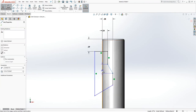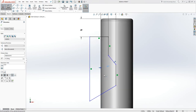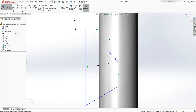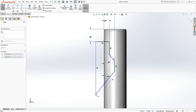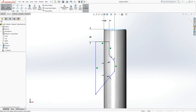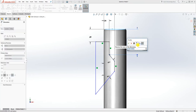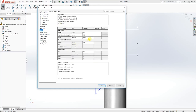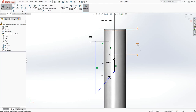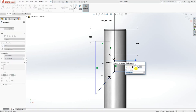This angle is going to be 41 degrees, and this angle as well is going to be 41 degrees. We are almost done — just need to add a couple more things. The dimension from the top face to this point is going to be 0.179. Let me change that to 3 decimal places so you can see what's going on — click OK. The only remaining dimension we need to add is 0.063.